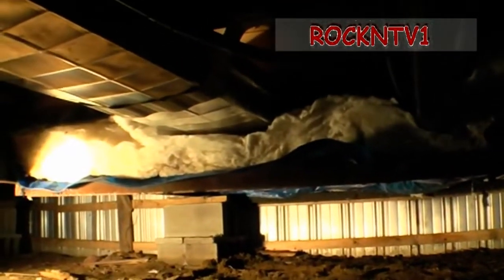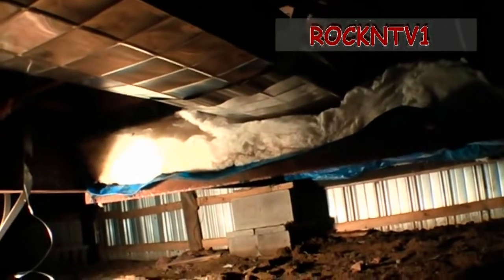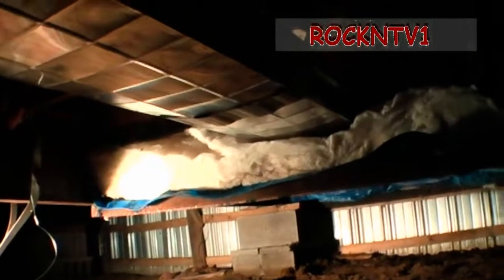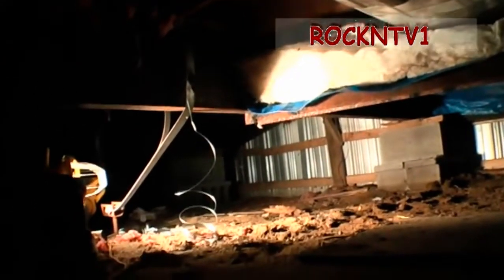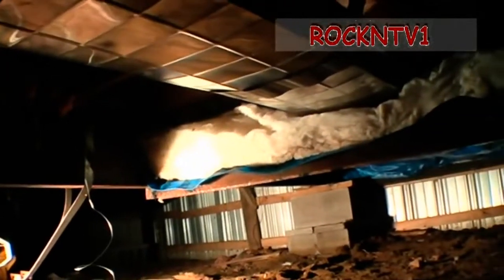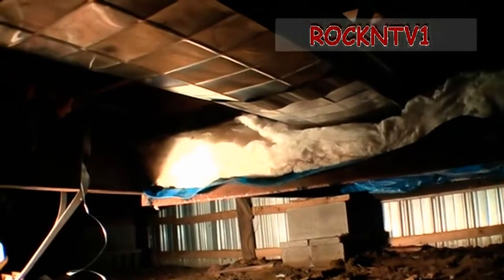There it is. It's a little dark, but there it is — the first section put in, R19 six-and-a-half inch insulation. The batts are glued down to the tarp. I glued them on there last night with construction adhesive, then rolled up the tarp with the insulation in it and dragged it in here. Then unfurled it and wired it with this roll of wire. The bag method here seems to be working out. It's far superior to trying to staple batts in bays just because there's no way. The original construction had this same sort of thing — they call it an insulation blanket that was laid down. I'm just trying to reproduce it, but using a little bit better R-value material than they used back then, and sealing it up as tight as possible. There's the first section put in.